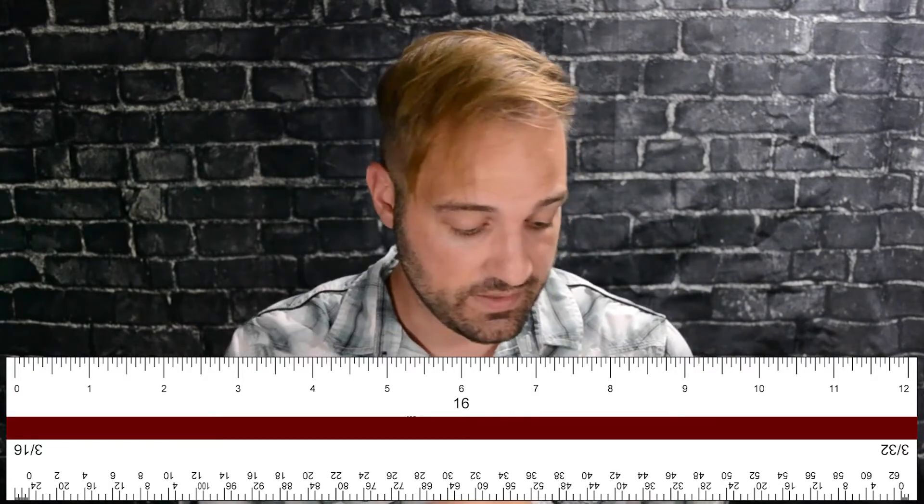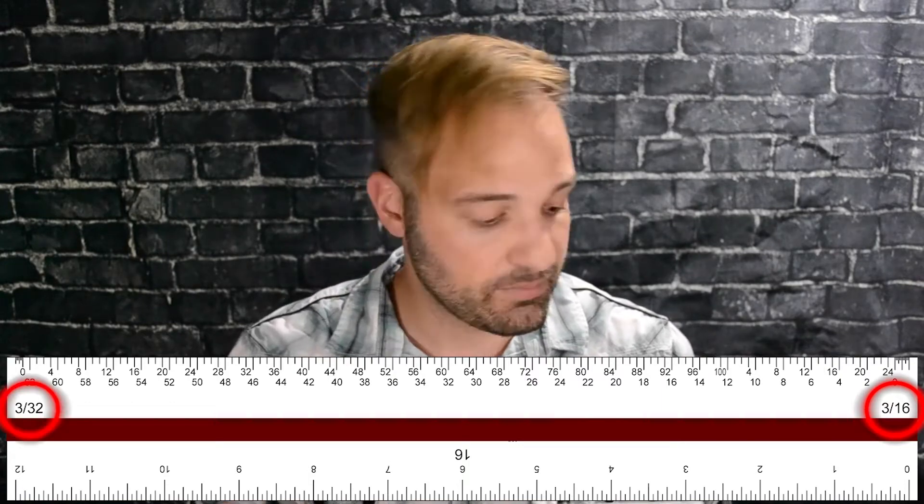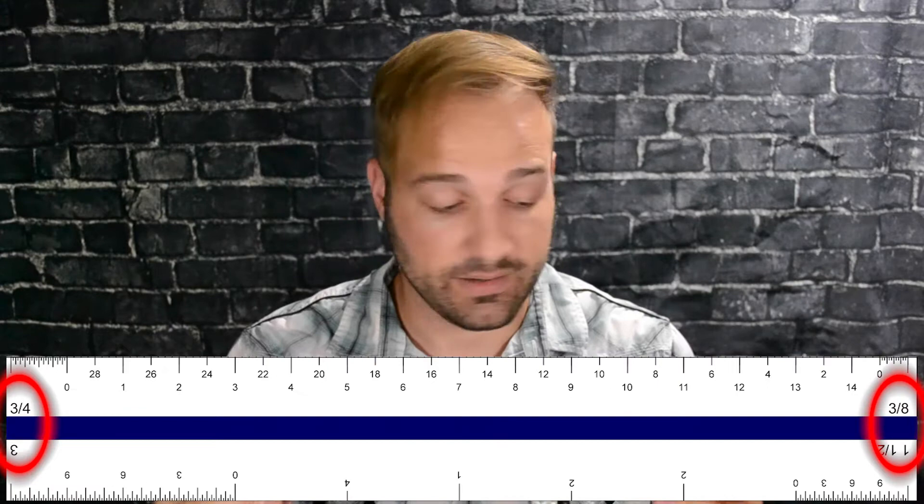If you face that one side to you, the top of it looks like a regular ruler, zero to 12. Now, if you look at the bottom all the way to either side, it says three thirty-seconds and three sixteenths. This is telling you that for every three sixteenths of an inch that we draw using this scale, that equals one foot. That's what the numbers all the way on the side on all three sides and all six points tell you.